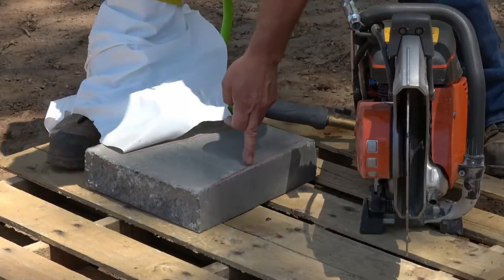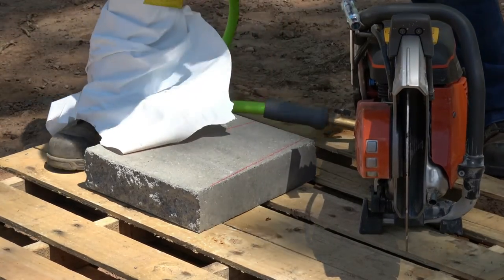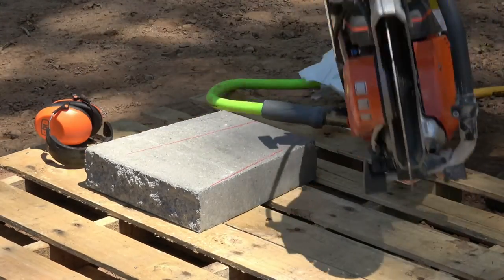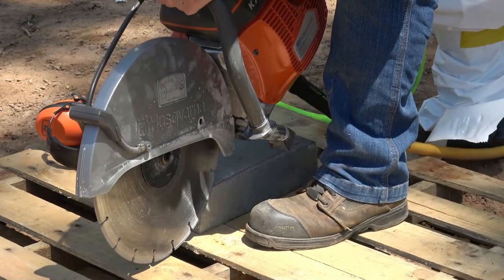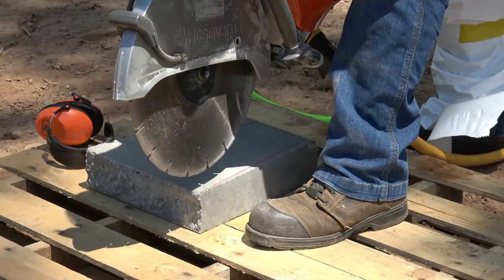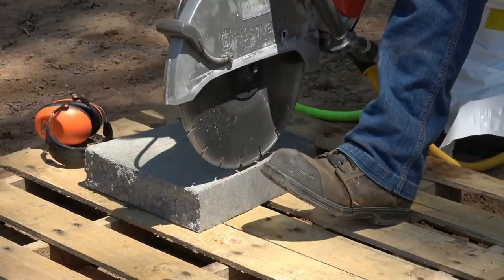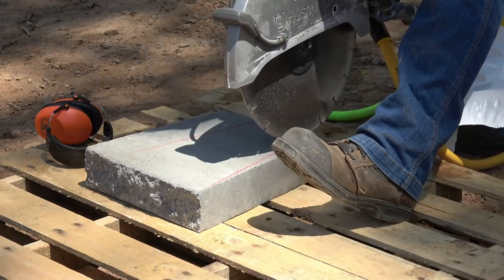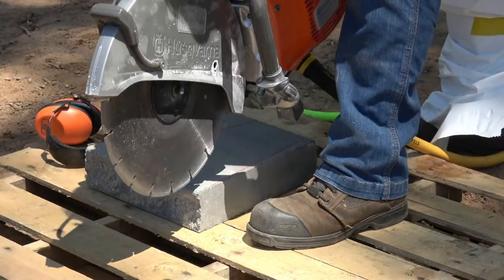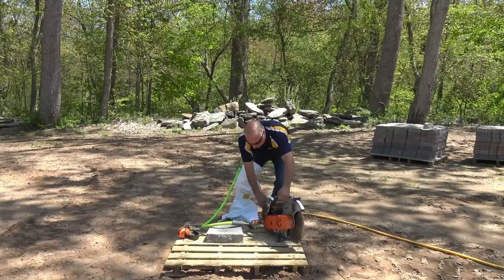If you're going out to the outside edge, you can watch this line and run your blade and it looks something like this. So when I'm cutting, I'll be over here and I can watch that blade all the way down to the bottom and then work my way back through my cut. You're gonna wanna score it first. You don't wanna start cutting back into the product. So score it first, you have a nice little cut line, and then do your vertical cut. I'll try to show that when I'm making that cut so you can see it.